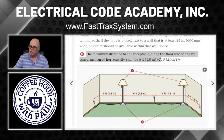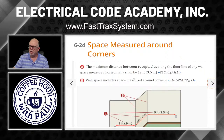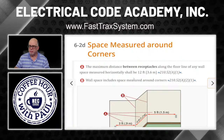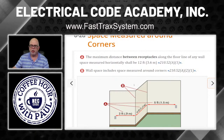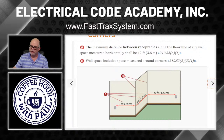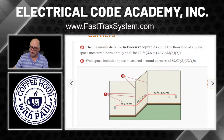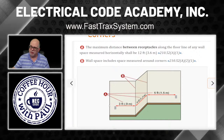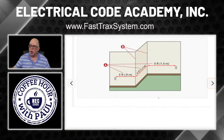When measuring the wall line, if the room isn't perfectly square, you follow the contours of the actual room. In the illustration, here's a receptacle and the maximum distance is 12 feet: five plus four, nine plus three equals 12. You measure to the corner, then measure this wall space, then from that corner measure the next one. Together that's 12 feet, but you measure around the corners. An electrician would typically measure from fixed point to fixed point along each wall segment rather than draping the tape around.